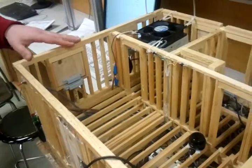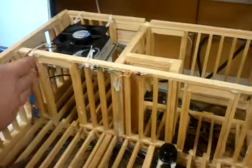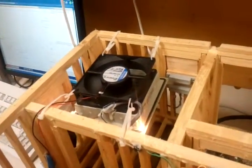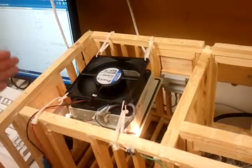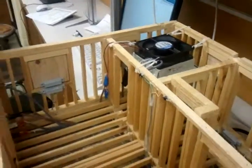We've also designed the bathroom — it's a true man's bathroom. As you enter, we had to mount the proximity switch on the outside of the building because of the close proximity in here. We couldn't dial down the sensitivity enough — it just kept coming on all the time. So we've got it wired out here to simulate going in the door. You go in, the fan activates, and the lights turn on. You do your business, you leave the bathroom, the lights go out right away, but the fan stays on for a nice time delay to get that stink right out of there.